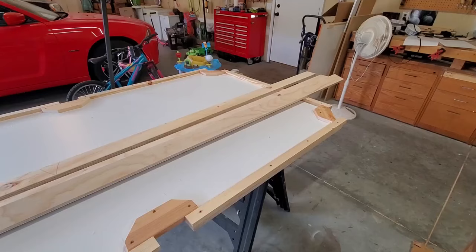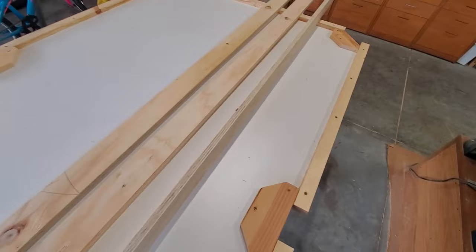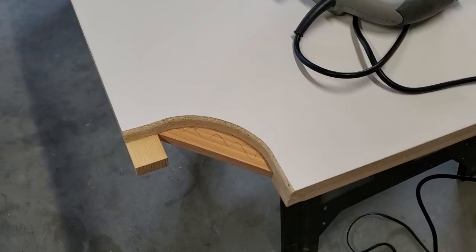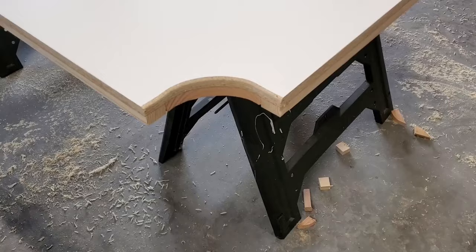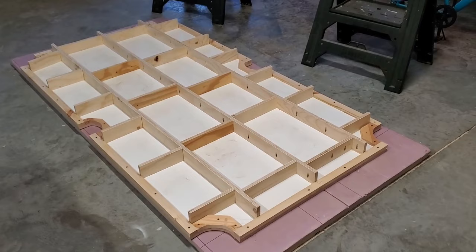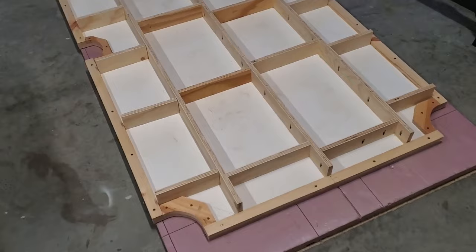Got all the backer boards glued on the sides and corners. It's upside down right now, so I'll have to cut that out to match the hole. I also got my support ribs cut — three main support ribs going across the bottom. It'll get pocket hole screwed all along the length, plus glued. That'll give the table bed a bunch of rigidity. I'll use a jigsaw to get it rough, and then a pattern bit with a top bearing for my router to get it perfect.